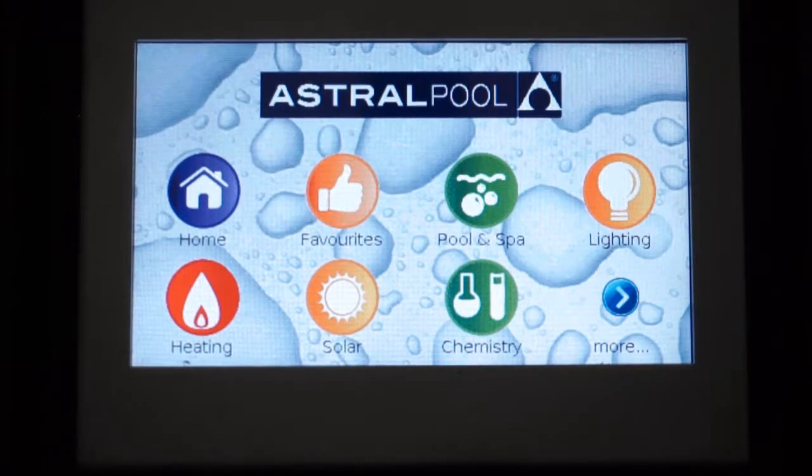So now what we have here is our controlled heater power, which is turning on our channel 3, and on our channel 3 we have the dedicated water pump, which is going to feed water to the heat pump and activate the water pressure switch. The heat pump is hardwired into an isolation switch, so it has constant power.